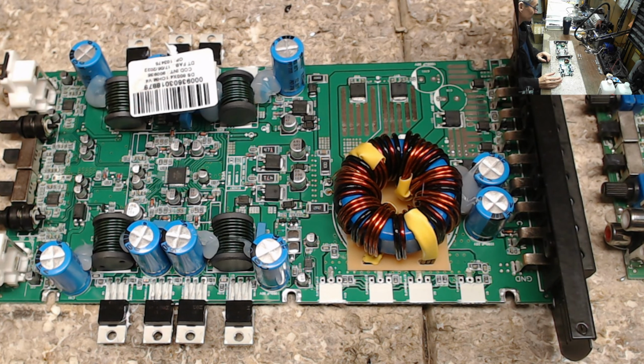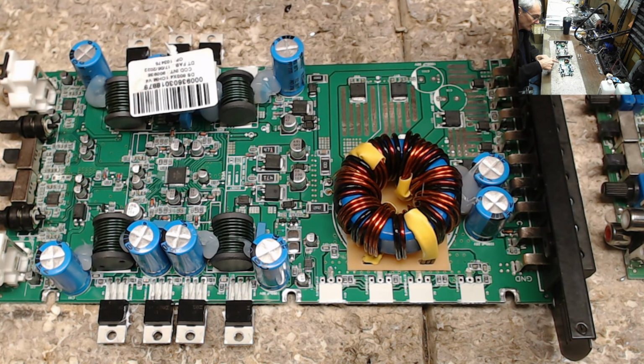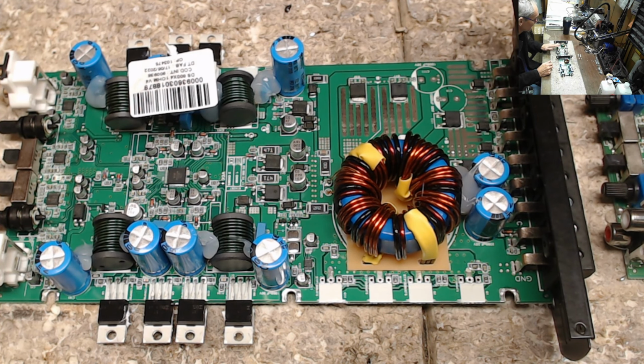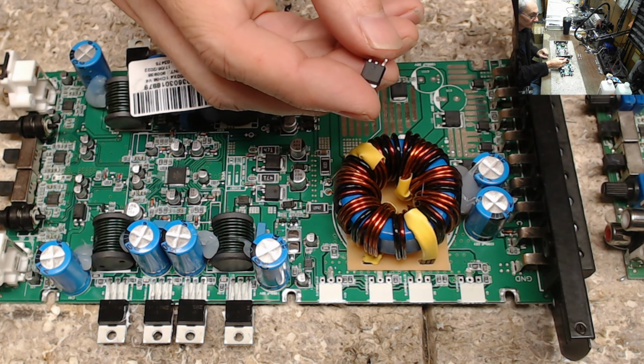I've noticed something about these, the DS800s here, these 800x4s. When the output section fails and overloads the power supply, I've noticed something about these rectifiers. Again, I'm not sure about this board. I don't show any shorts, but something has overloaded the power supply, which probably was the heavy clipping. But lo and behold, these amps are popping these rectifiers here.